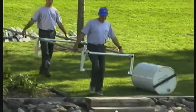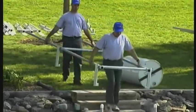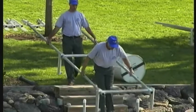We recommend two people carry the 16-foot framework together. The starter bracket should be installed on the ground, out of the water if possible, with the intention that it will remain in that position permanently. This will provide the exact angle and location for future years' installations and is easier for reinstalling the vertical pipe into the ground surface holes that did not fill in.